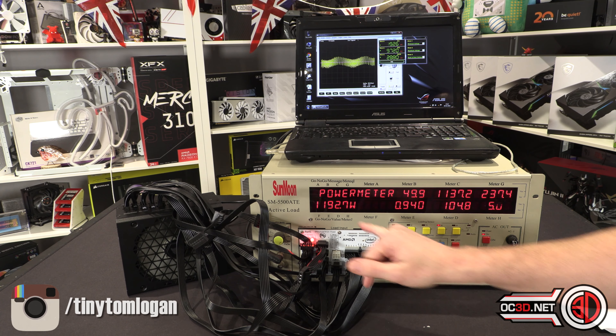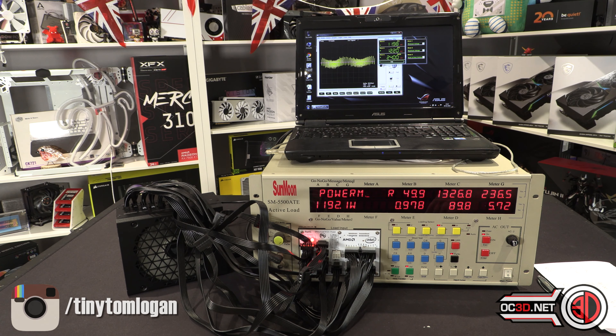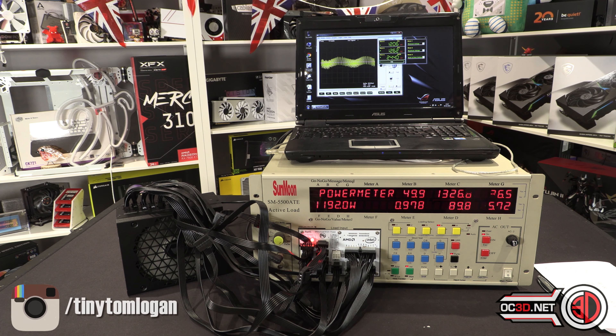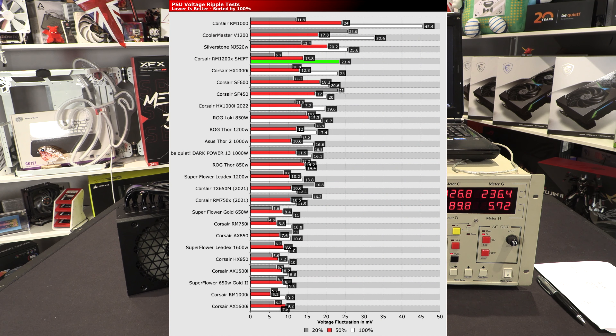Flicking up to 100%, we're about seven watts below 1200 watts. The power supply fan has instantly started going absolutely crazy. Efficiency is 89.8%, occasionally flicking up to 89.9% which was the result I took. The millivolts are running at around 24 to 25, varying down to 23 and occasionally bursting up to 25. I've not seen a millivolt result like this since the original HX1000 — so you've kind of got old-school HX performance in an RM-labelled power supply now.